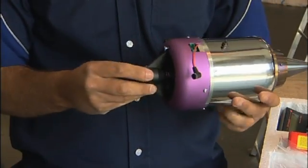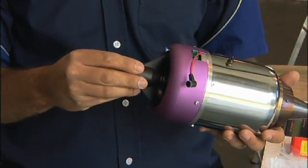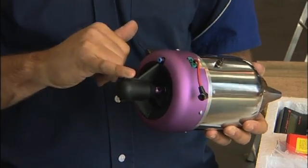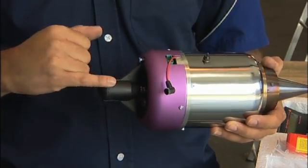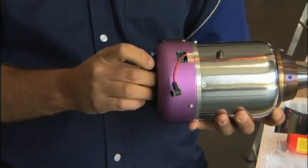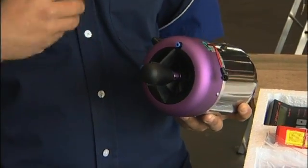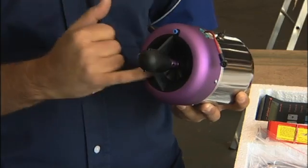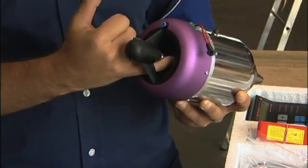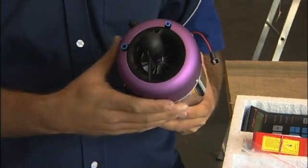This is the all-important bit that has revolutionised turbine operation — that's the onboard starter. What we have in this capsule, or the starter module, is an electric motor connected via a Bendix clutch, which is totally isolated from the compressor wheel right now. But on application of the start sequence, it will engage that compressor at the front, rev the engine up, and rotate the compressor to around 30,000 RPM, where the engine will then begin its fully automated start process.